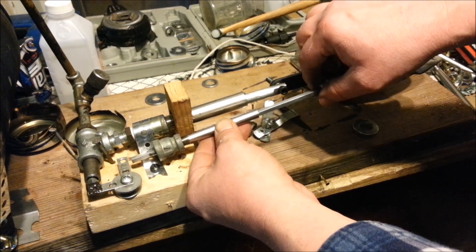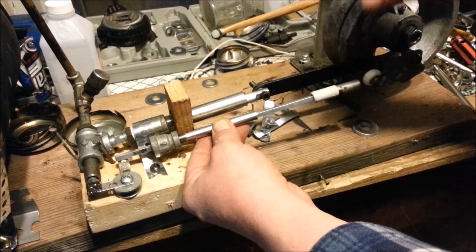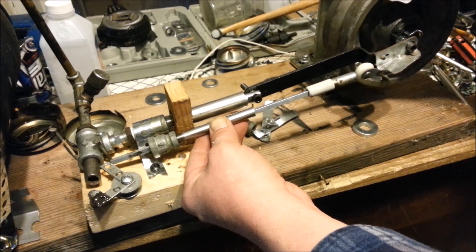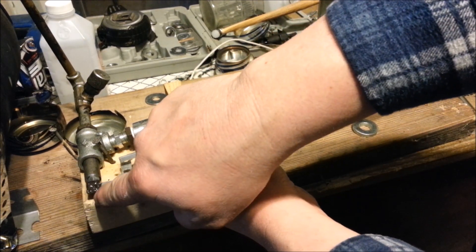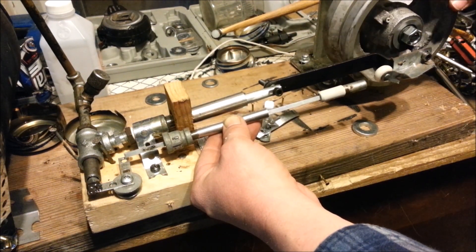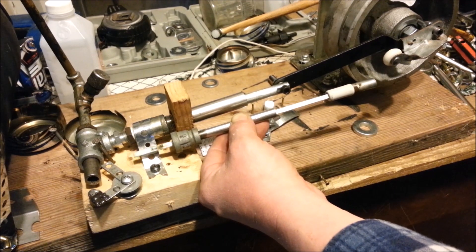This other tubing will be mounted right next to this tubing, right about this area. When this roller comes down it's going to hit the actuator, forcing this open, and just as it gets open this wheel will clear that. With the spring, this will be forced back closed, forcing the flywheel on around again. It will just keep repeating that motion as steam is forced through.